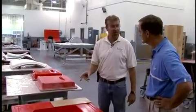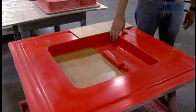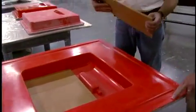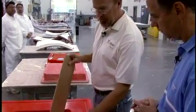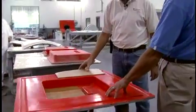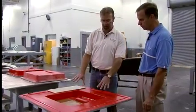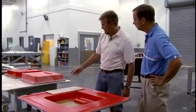With compression molding, we get a finished surface on both sides of the part. It takes two molds. We develop the outer mold first, and when we engineer the thickness of the part, we can buy different thicknesses of sheet wax. That's what we form inside the outer mold to create the actual part thickness. Then we lay up an inner mold, which is right here.